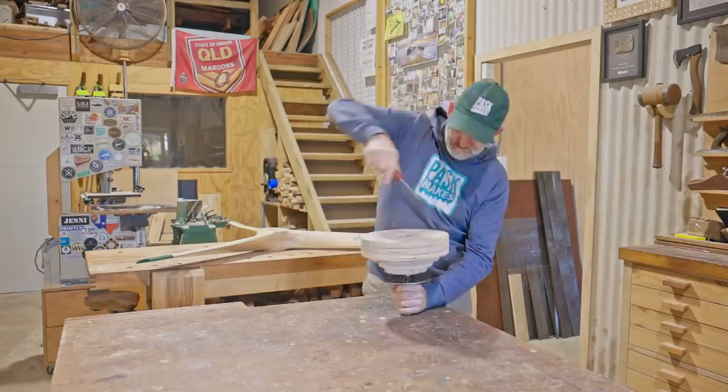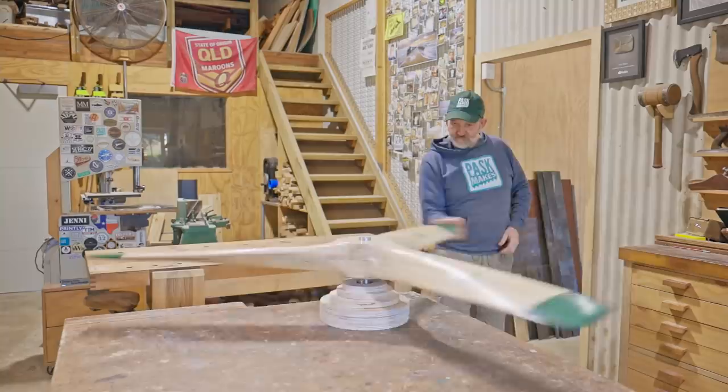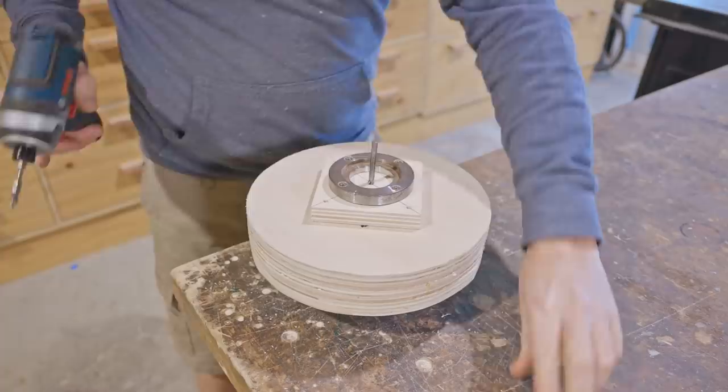That's all looking good so now I'll put it on the lathe and turn it down into a cone. I'll use one of the plugs from the hole saw to help center the mounting ring. It won't be a hundred percent perfect, but it will be close enough.